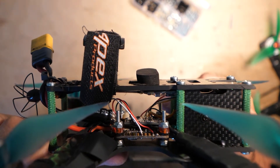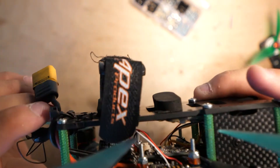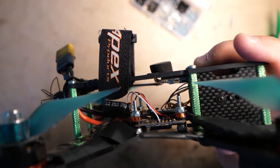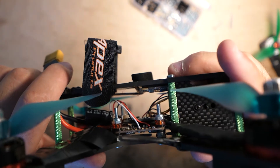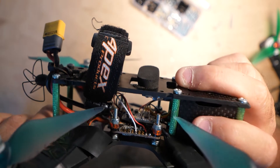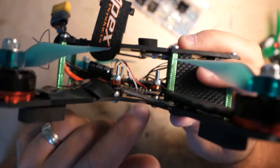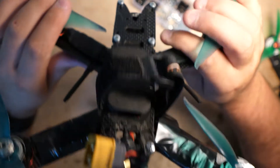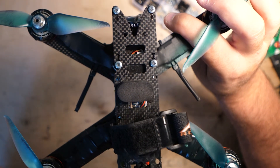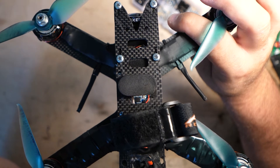The next thing I want to talk about is your receiver antenna. My flight controller and PDB are all one board — I'll tell you what that is later. I use the FrSky XSR S-bus receivers, sandwiched right on top, held with double-sided sticky tape. The antenna wires run around to the side, across the arm. If you're trying to do long-range flying, this probably isn't the solution for you. But for racing, hands down, this is the only way you should ever mount your receiver antennas.